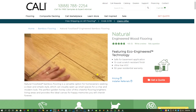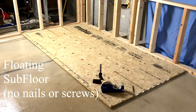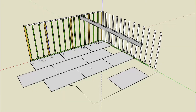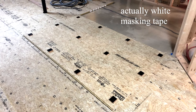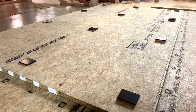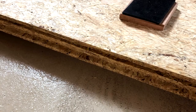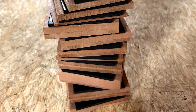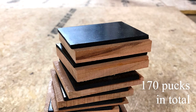The wood flooring I was planning to install required a very flat floor. I decided to install an OSB subfloor, and I would make each 4x8 sheet of OSB level using custom-made levelers that I called pucks. As I laid out the position of each subfloor sheet, I marked 15 points with blue tape on the concrete, spaced about 2 feet apart. I took height measurements at each point relative to the highest spot on the concrete and wrote that measurement on each piece of tape. Then I proceeded to make pucks out of wood and rubber, each to a custom thickness matching the depth marked on each tape.